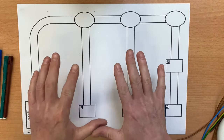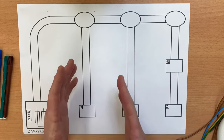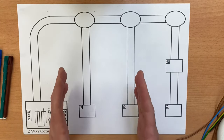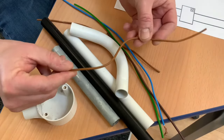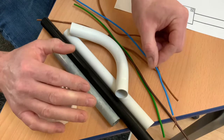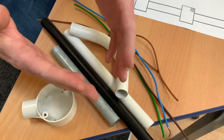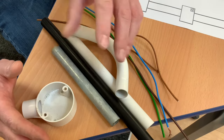We're back looking at our conduit looping method for wiring a lighting circuit, which is different to how we wire in twin and CPCs. This series is concentrating on wiring circuits in PVC singles. Those PVC singles are stranded for greater flexibility, and we know for a lighting circuit in a conduit or trunking system the minimum cross-sectional area with PVC singles is 1.5mm².